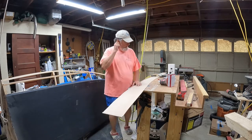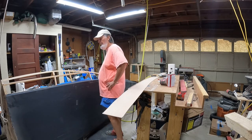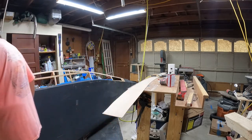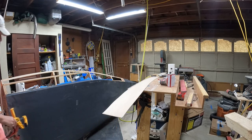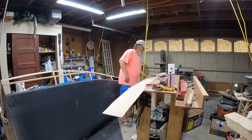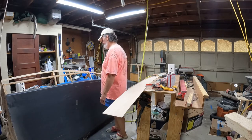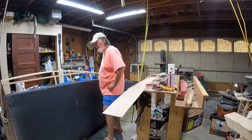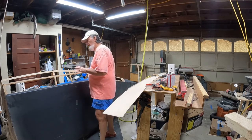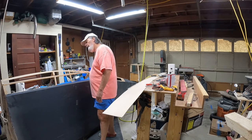So what we're going to do here — I need to mix up some glue, get ready to put it in there. I've got a few little clamps around in case I need them, but I'll probably just clamp one end in, clamp the other, make sure it's in there good, and then staple it out. I think I'm going to drip straight West System in there first, and then go in there with the filler, so it's got solid wet in the bottom and it'll soak into that wood good, and then you come back in with the filler. That's what I'm going to do — I'm going to put a pretty good bit of West System on that.